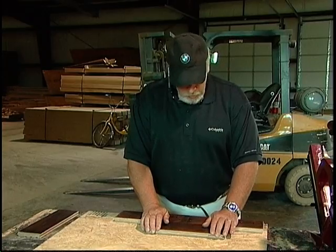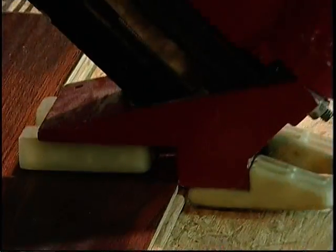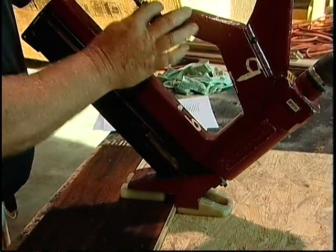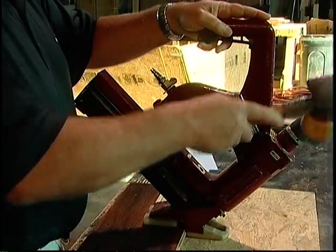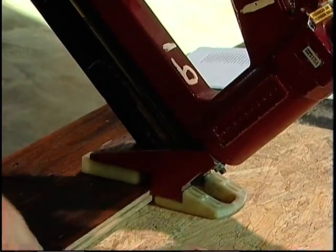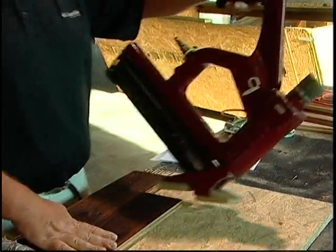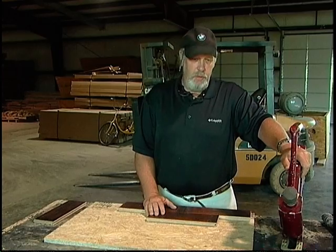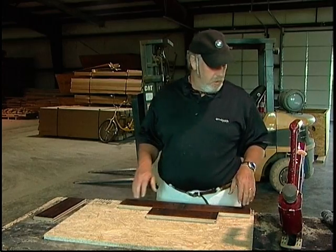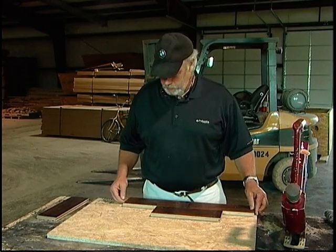Miss your joints about three inches. Now this is a pneumatic nailer. All this amounts to about a 40-degree angle. It goes on here — it's obvious — it goes into the tongue, clips on the side. You hook your air hose up here, take the hammer, pop it, and it'll drive the nail. Some you want to hit harder because if a board has taken on some moisture, it may have just a little turn in it and you'll have to hit it harder. The manual nailers are for young people — you have to hit it hard every time. For those of us who are older, less effort is always good. Leaves you a little more time for cigars and beer.